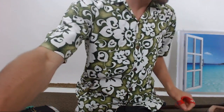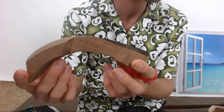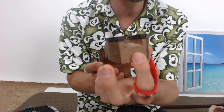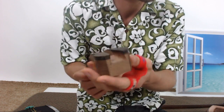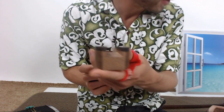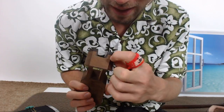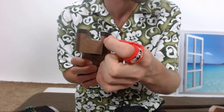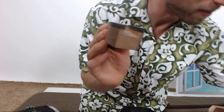Okay, that's that. We saw the dough. Here's the update on the Shamisen progress. Cut the mortise. This is a little bit bigger than usual. Why did it get that way? I got carried away with the chisel. But fortunately, the saw is still thicker. The saw is going to come to maybe 3 millimeters from that corner there. So not that much contact, but that's okay. I'll be careful not to split the wood.